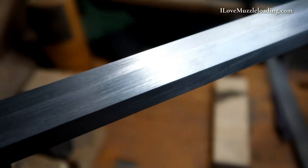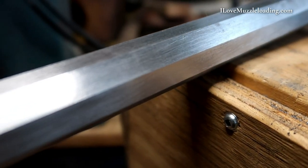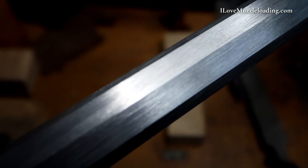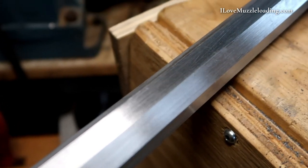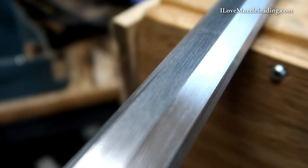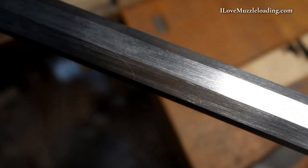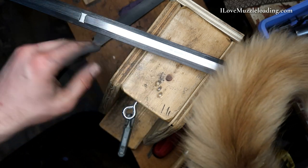And there you have it — that's how you can go through and draw file your barrel. Give it a nice traditional look before you head into your metal finishing, whatever solution you're going for. It takes just a little bit of time. I was probably here working on this for about 45 minutes total — really not a lot of time in the grand scheme of things, especially when you consider the traditional proper look you get out of this technique. Again, not something you have to do, but I think it's one of the better ways to have your barrel when you go into the metal finishing solution. So I hope you've enjoyed this. Keep an eye out for the next video where we're talking about browning and building a browning chamber.